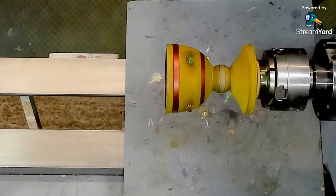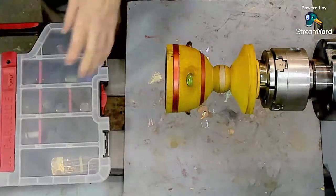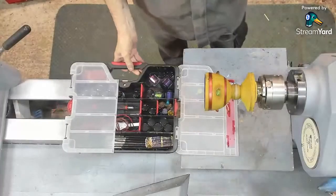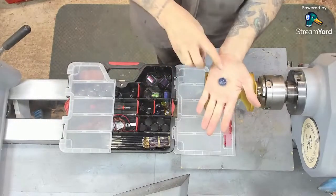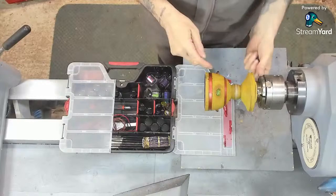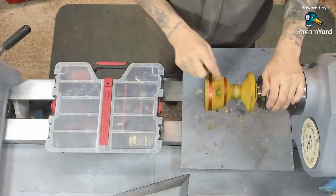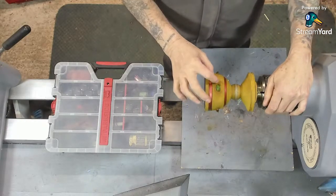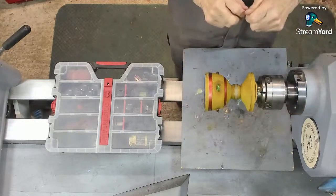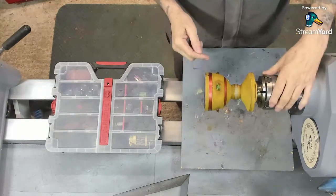Those little gems were actually glass beads. I think I showed you them last day, but I'll show them again just so you understand what I did. I'll just grab the bead box. It's a little box with different bits in it. So these are these little glass beads. You see that one better. What I did was I cut them in half. And then I used my small rotary tool from Woodart, and I made a recess for the gems to sit in. So I had to mark it all up. Because they're all different sizes, mark them up and then draw the outline. The easiest way to do that is to put a little bit of double-sided sticky tape on the back of your gem, stick it on there, and then draw your line around it. And then you can carve it out easily enough.